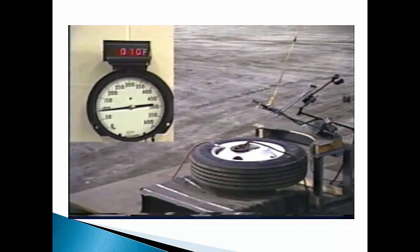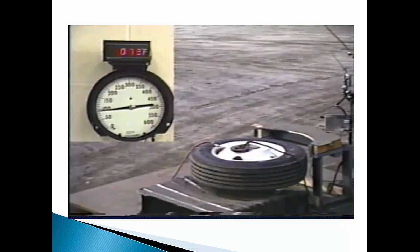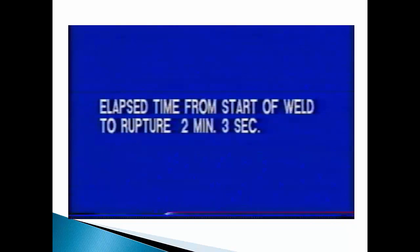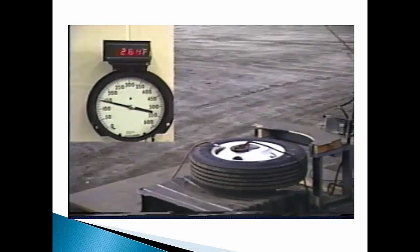These are the reasons why you would never weld or torch on a wheel or rim with a tire on it. Number one, it violates OSHA regulations. Number two, wheel and rim servicing needs to be done by experts — leave it to the certified wheel service company or the factory. Number three, you can start the process of tire pyrolysis, producing flammable gases within the tire from the tire beginning to break down internally, resulting in extreme heat and pressure until it finally explodes. Bridgestone's Jack Dutcher did an excellent video on this whole issue. It can be found on YouTube — search for 'Wheels of Fire training video.'